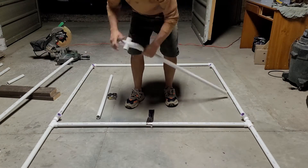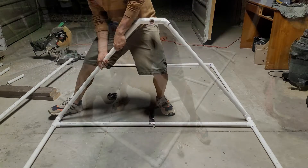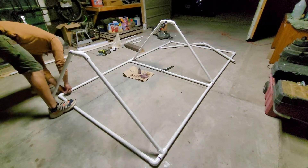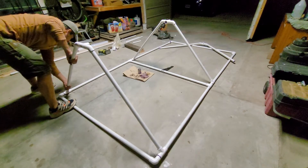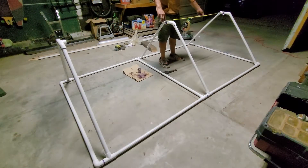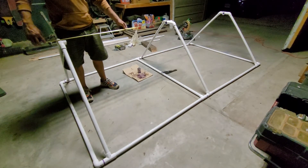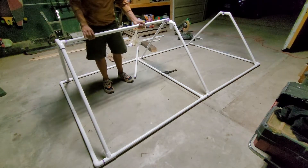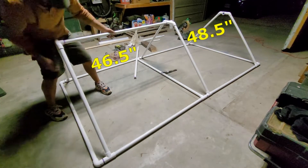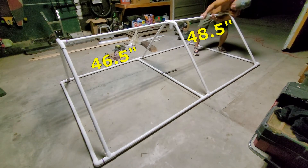During this step, you will probably need to adjust the bottom three-way tees to match the 45-degree angle at the top, which can be done just by twisting the tee. This step is one of the main reasons I like to wait to glue these fittings. Then once I have these sections installed and plumb, I then measure the distance between each section and cut two more pieces of pipe. Because there is a slight two-inch offset on the top of the frame due to the bottom three-way tees being centered, one of the sides is two inches shorter than the other. So I have one piece cut at 46 and a half inches and the other piece cut at 48 and a half inches.